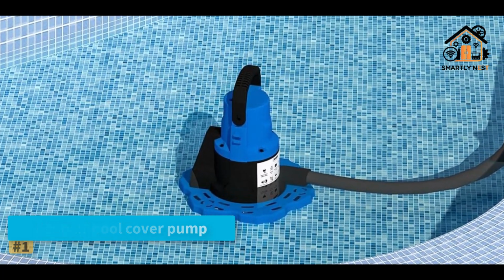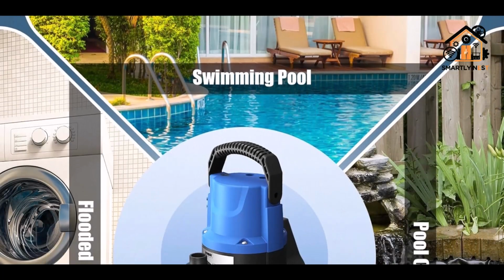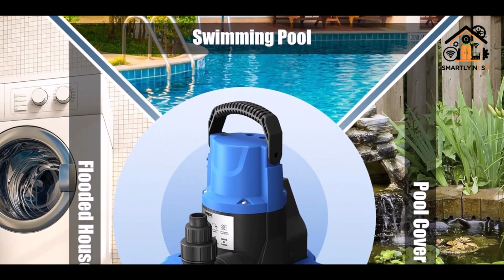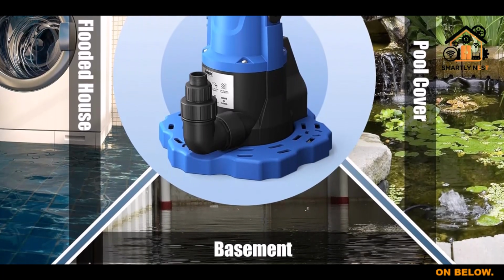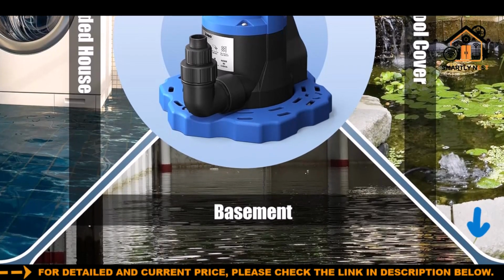One of its strongest features is the automatic on-off switch, which activates the pump when water reaches 2.17 inches and turns it off once levels drop below 3/4 inch after a 30-second delay. This convenient automation saves you from the hassle of constant monitoring, especially during heavy rainfall or snow melt.